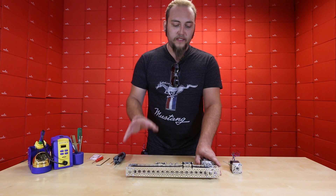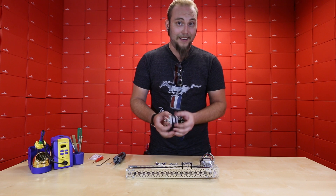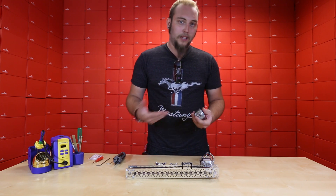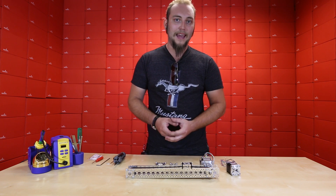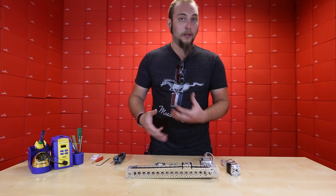But if you want nice precision, repeatable linear motion, you need the right kind of motor — in this case, a stepper motor. The nice thing about a stepper motor is that it moves in tiny steps that you can record and repeat reliably so that you have the slider moving to the same position every time. This comes in handy when you want to do something like draw, print, or automate some assembly process.